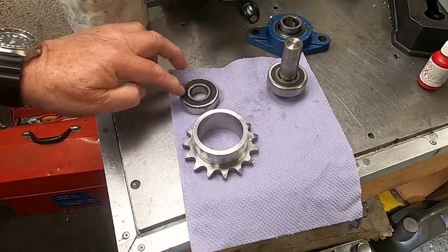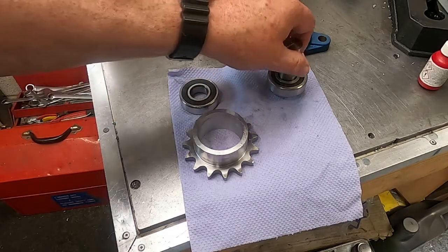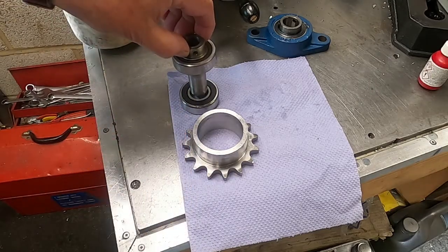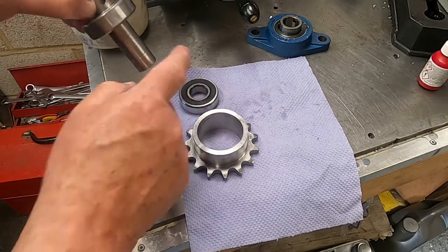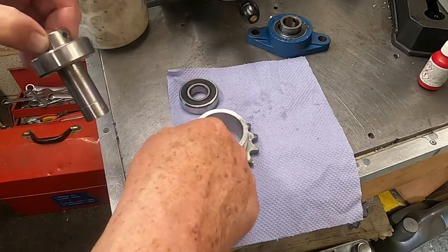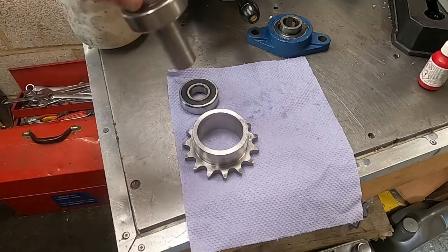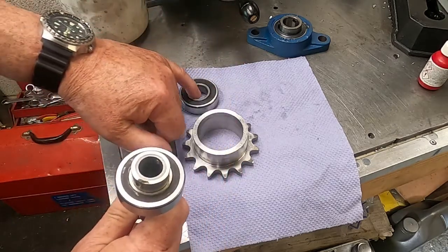Then I'm going to put a little shim in on top of this, about 80 thou I've calculated. And then I'm going to use this as a centralizing element with some Loctite on it, so that ultimately the inner ring and this will be Loctite together. And then I'll have stuff around the outside here, or rather the inside of the hole, and also around this bearing, this sprag clutch, so that this will all go in. It will be centralized on the bearing.